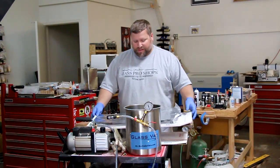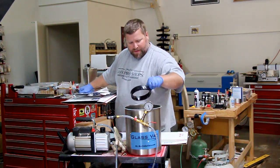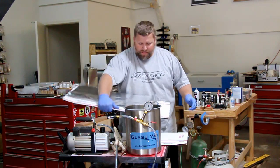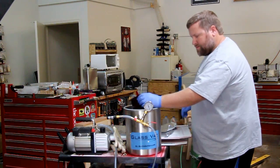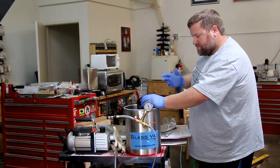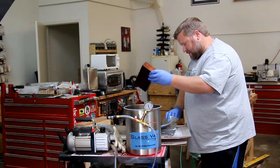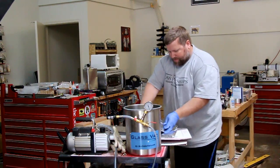I've let the wood soak — it's actually soaked for about a full day. I'm going to take my weights out and let everything drip off. Then I've got some foil laid out and I'm going to wrap each block in the foil. Just picking up this block of wood — it was fairly light before — it's probably doubled, tripled, quadrupled in weight. It's really heavy now, and that's what we're after: getting all that air out and filling it with the resin. I'm going to wrap it in foil as snugly as I can.